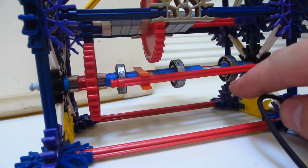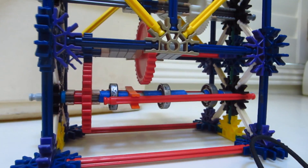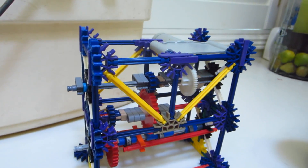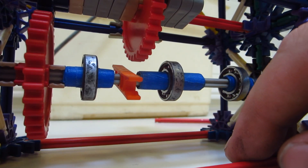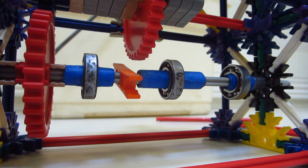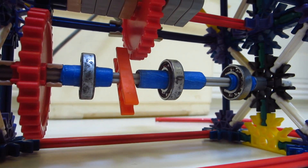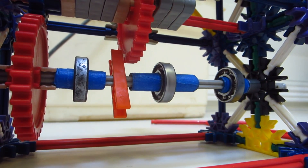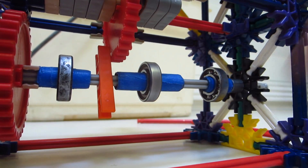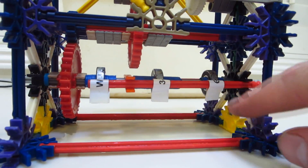It's going to sit in there until enough water evaporates so the bearings are out of the water - it could take maybe a whole week. Then I'm going to open the bearings up and see what they look like on the inside. The motor won't be running the whole time, but it will be running for one or two days at least. These are the three bearings I revived that were completely seized with rust, and they ended up in pretty decent condition with some life left in them.